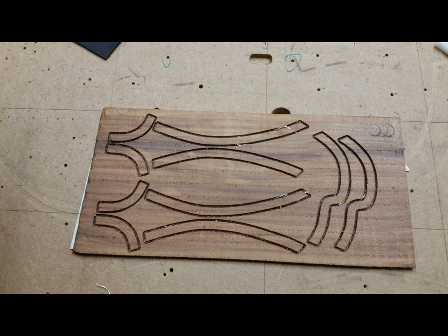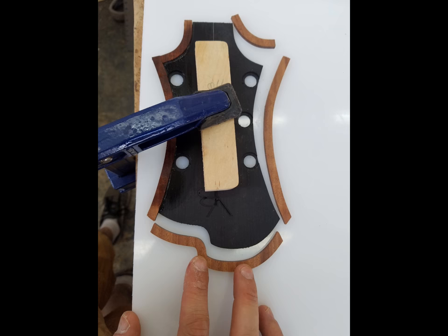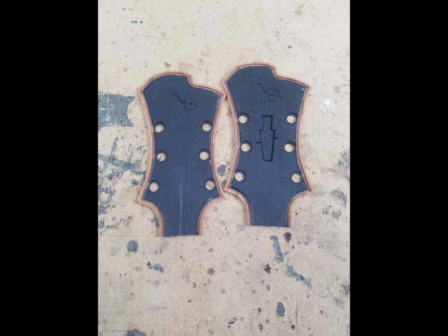There you can see that's two guitars worth of koa — I'm doing two at a time here. After these pieces are cut out, we take them off the table. This is my assistant working on some of the project here as well. The pieces fit right around that outer perimeter of the headplate. That's some non-stick plastic that we're gluing the edges together with, just so we don't glue it to the table, but it allows us to keep it flat.